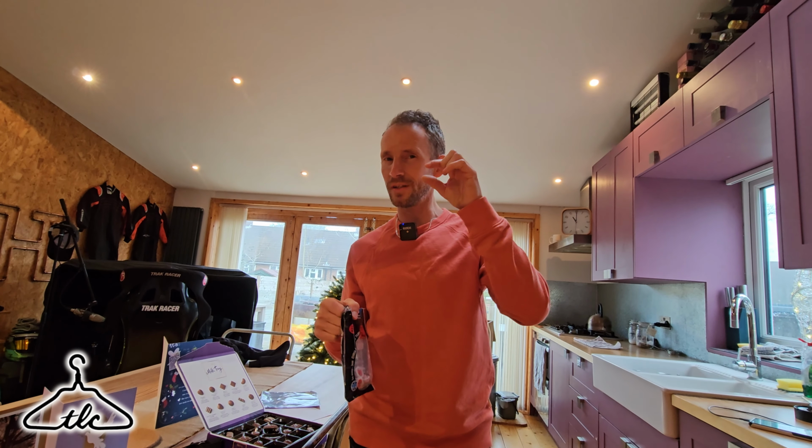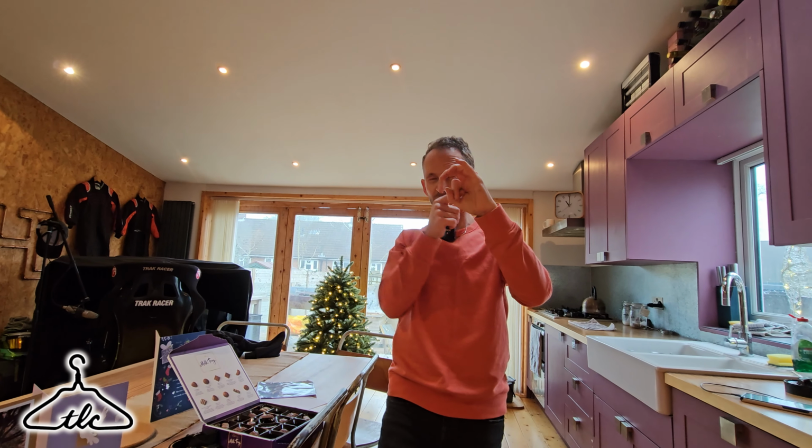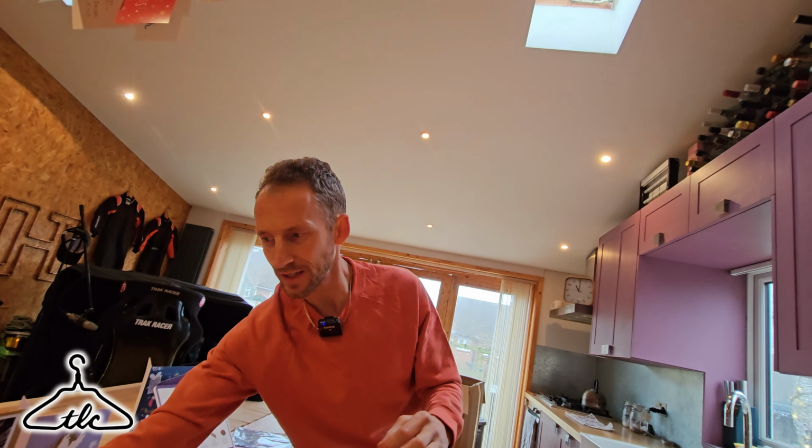So if you've got dot and dab, so if your plasterboard is being glued on, you've got to watch out for those dot and dabs, because if you drill in that particular space, you'll either have to scoop out the dot and dab where it's holding on to create a little mini void, or re-drill a new hole, because these fixings require them. So yeah, this is what they look like.